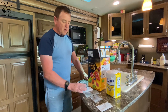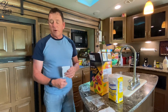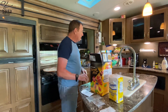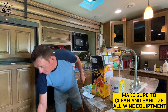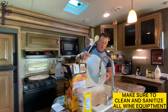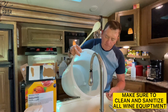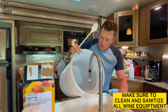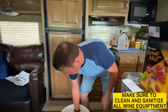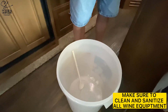So what we're going to do is start with the bentonite. The bentonite is the first step — we're going to put it in a bucket with some warm water and mix it up. I'm going to get some hot water into it; it'll work better. I've got about a gallon of water in here, and now I'm going to put the bentonite in. I won't mix it all up at once — I'll mix it up a little bit at a time.